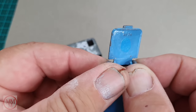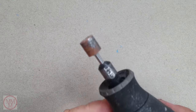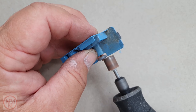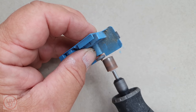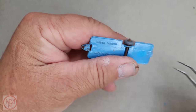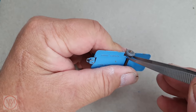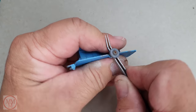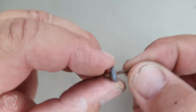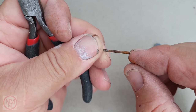The wheels on the base are jammed — this one in particular, because the axle is rusty and has swollen, locking the wheel. First I remove the end of the axle with a cylindrical grindstone in my Dremel, then I try to pry the wheel off using angled tweezers to lever it off. I force them in and because they are tapered it manages to lever the wheel off the axle. The second wheel was tough too — it moved over half the axle but then hit the rusty section — but I got there in the end.